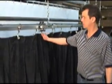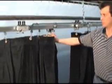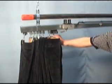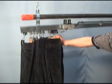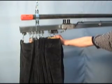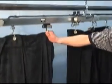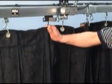Turn the machine's power source on and press the open push button. The machine should operate, but the curtain will not move since the track has not been corded yet. With the machine operating in the open direction, manually move the master carrier in the open direction until it trips its limit switch. The machine should shut off when the limit switch trips. Repeat this process for the closed limit switch.